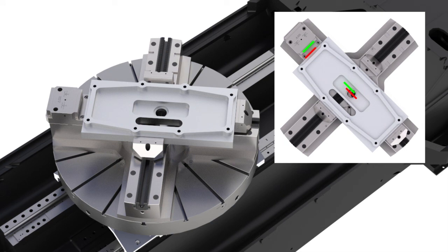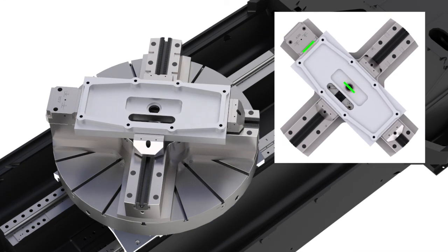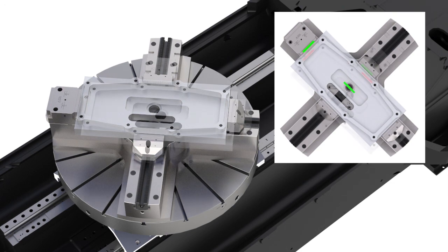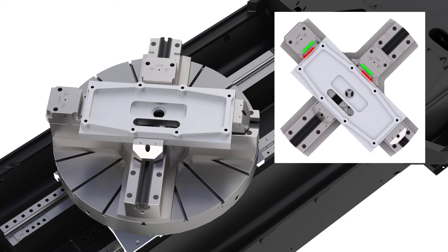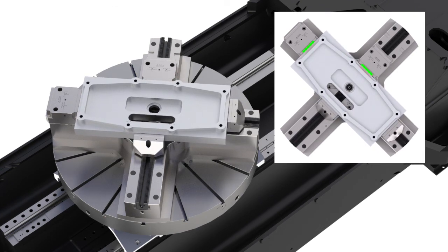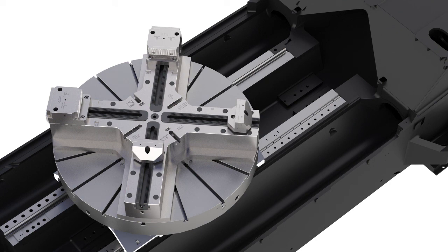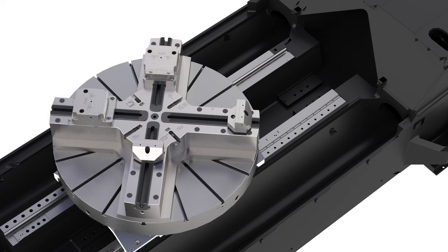In addition to this, you have the possibility of vise clamping with one stationary jaw and one clamping jaw in combination with two jaws for the concentric alignment of the workpiece in the 90-degree offset axis. Logical is the extension of the vise clamping with two stationary jaws and two clamping jaws for clamping with two fixed reference edges. By moving the stationary jaws, the entire clamping range can be covered effectively.